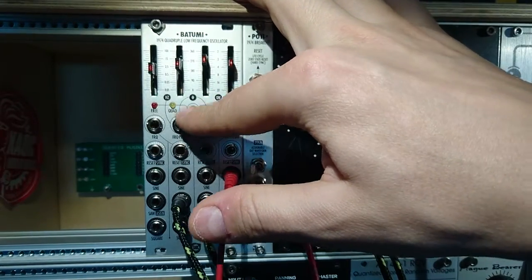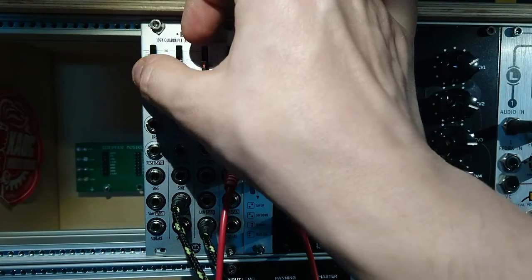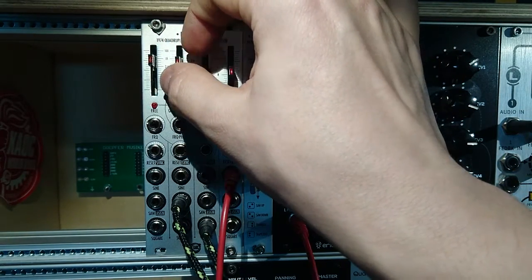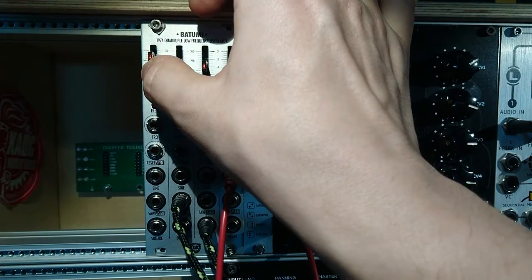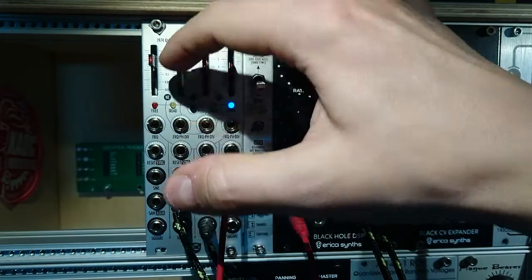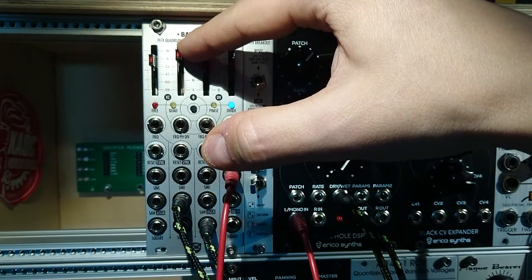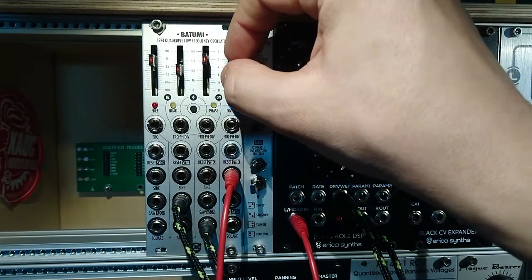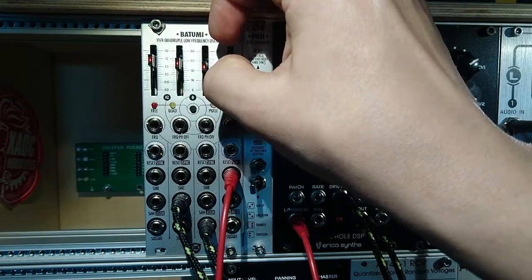And the fourth one is called divide, and this mode is also similar in the matter that the three LFOs are also synced to the first one, but not in the phase way. More they serve as kind of like a clock divider. So if LFO number 1 goes fast, then you divide the speed of the first LFO with the fader of each LFO, for example, so it goes twice as slow, now divided by 3, by 4, and so on and so on. It's really interesting and it's really useful in all kinds of percussive and rhythmical patches. So these are all synced.